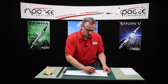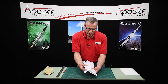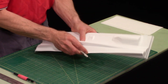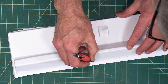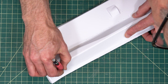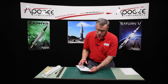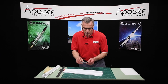To cut this, you just score along the plastic. You don't have to cut all the way through — you just start bending it back and forth, and it weakens the plastic, and then finally the plastic will start splitting on its own. Then just cut through the edge right there. Now you can see the edge a little bit better. On this edge, just cut along the bottom like this. We're going to trim this away later. For now, just cut it square — that's perfectly fine. Now I'm going to go back with a marker and re-mark this so you can see it better.